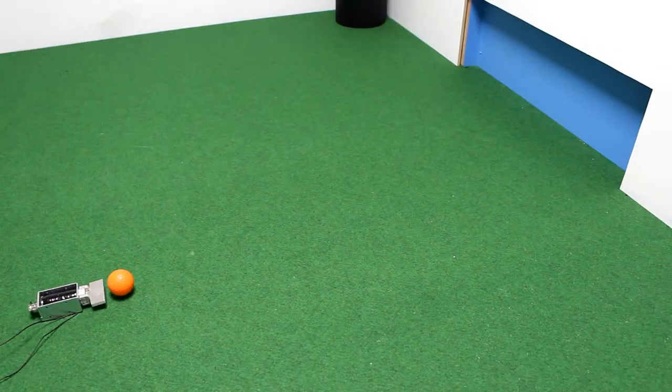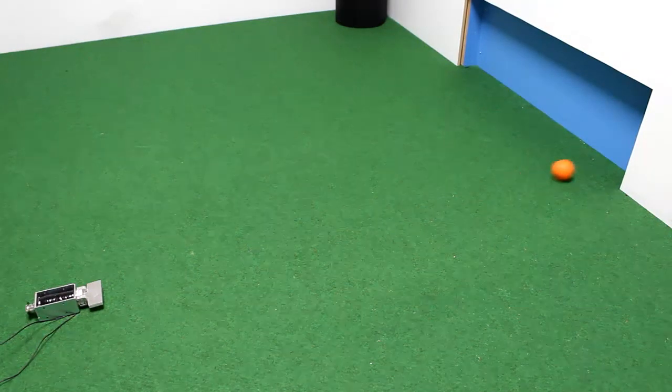Through further implementation, the proposed kicking mechanism is to be a solenoid actuator due to its simplicity yet broad range of kicking speeds. Incorporating a durable aluminium kicking plate, a high-strength 36-volt solenoid actuator is powered by an additional DC-DC boost converter, producing an adjustable output of up to 50 volts, capable of kicking speeds of up to a metre per second.